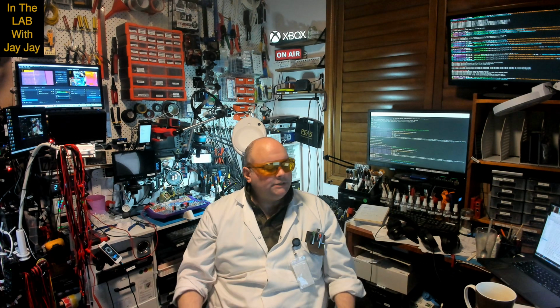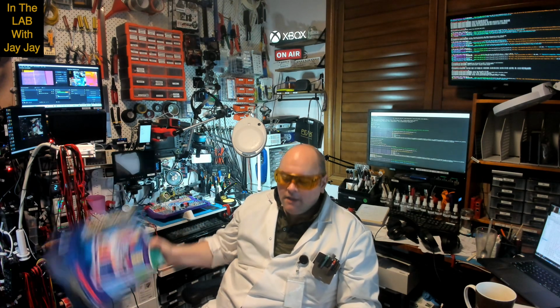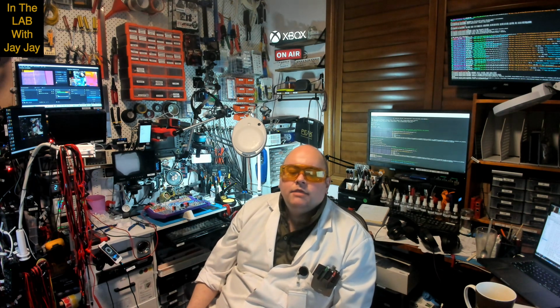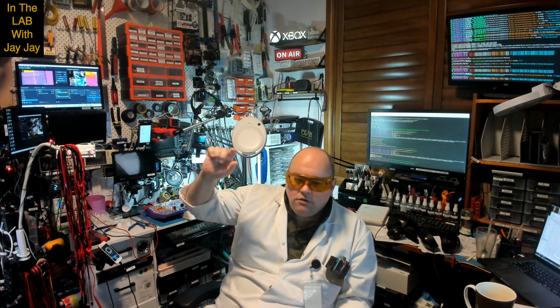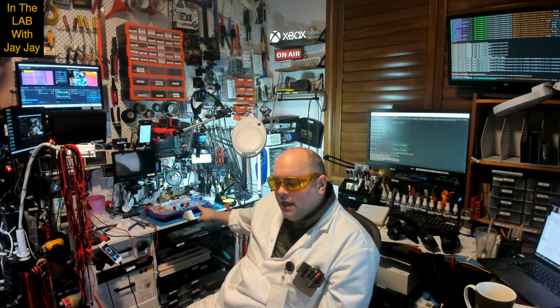That's a wrap. So yes, that concludes Project 12 of the Maxitronix Sensor Robot 20. That was a bit of fun investigating the behavior of a reed switch. I didn't know those properties. I thought that it was a normally open system, and that you used the magnetism to close it. So I was a bit surprised to learn, but of course it makes sense, because usually you use them on doors and windows and stuff, and usually the door is shut, so the reed is activated. So you want that to be the low power state. Anyway, it was good fun to break out our two little magnets and play with our reed switch.